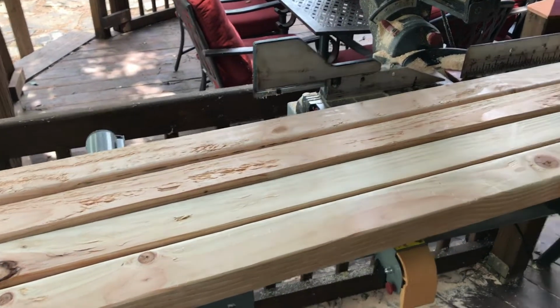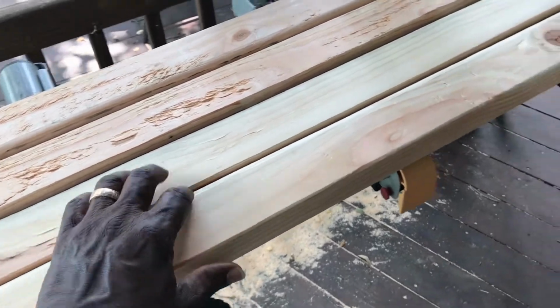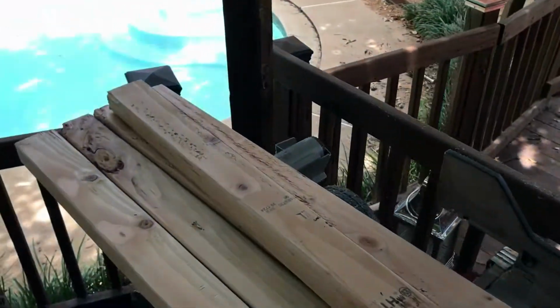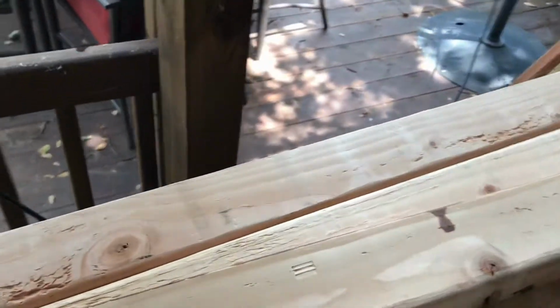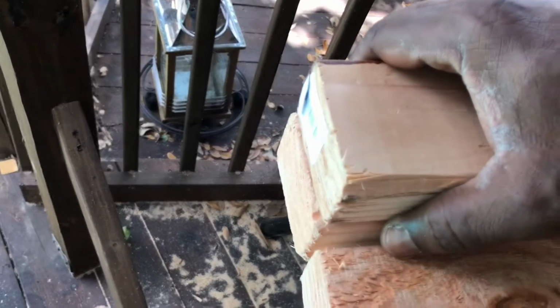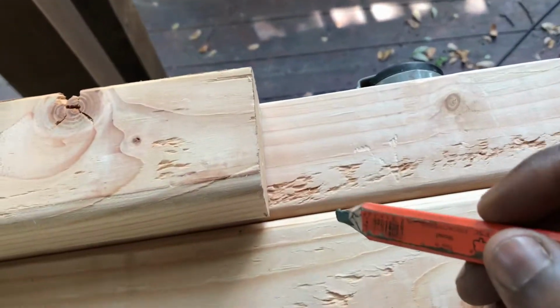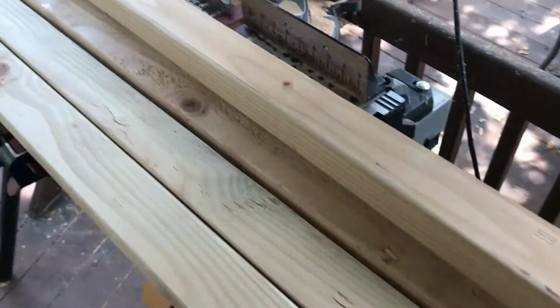Okay, in case you wanna know what size boards I'm putting on top is the roof over there. These are 2x3s. And what I did, I measured it out. One board here is my guide. It's already been cut, the size of the ones that are on the top over there, so I don't have to use a tape measure every time. I just kind of line this one up and trace the line. One here, take it all the way down, make sure it's flush on the end here, and take my trusty pencil and trace. Yeah, now I don't have to use the tape measure. You just take it, make your little line, move it to the next board, continue on.